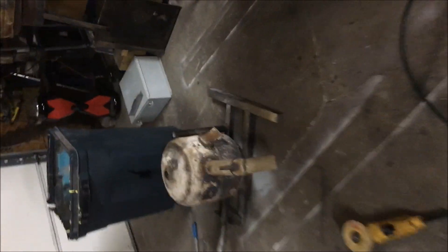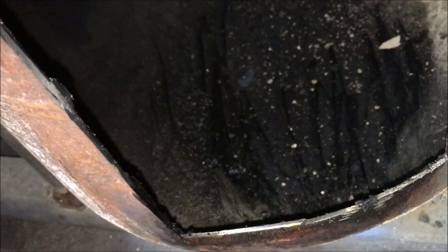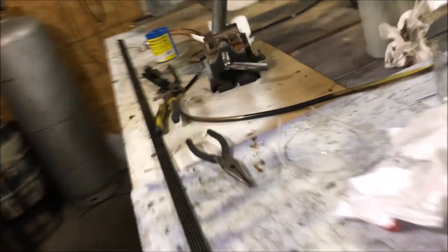I'm starting to think this is actually some type of residue from the combustion of the oil. On this waste oil burner I've decommissioned — some of you have seen this in action — when I cut it open to inspect the inside, the bottom of the tank was loaded with crud, probably three inches deep, almost all the way up, with gunk and dry ash. It was caked, almost slagged up. You can see where I scraped a lot of it out. Some of that could have been from the rags used to ignite the device, but I'm almost positive it was residue from combustion of the oil. There are a lot of different compounds in motor oil that would leave these kinds of residues.